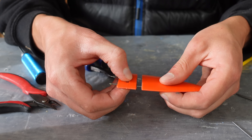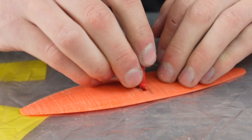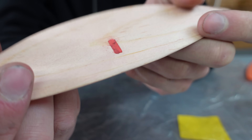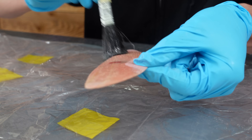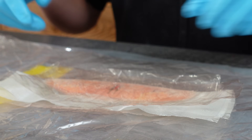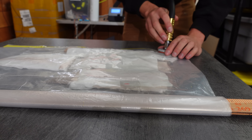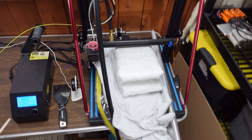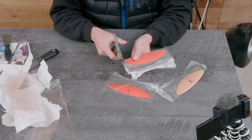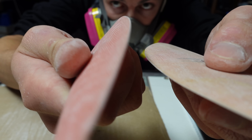I printed these in three parts and glued them together with some rods for alignment. The major downside to 3D printing these is that they have little FDM ridges, so I had to do a whole lot of sanding. Once they were fairly smooth, I plugged the rectangular holes with clay so they would not get filled with resin when I fiberglassed them. I mixed up some epoxy and painted it on the foil, then covered the whole thing in a few layers of 2 oz glass, wetting the cloth with epoxy after each layer. After the fiberglass came a layer of plastic film, then breather cloth to help smush everything together when placed in a vacuum bag and the air is pumped out. I used my 3D printer bed as a curing oven, and a few hours later I took everything out of the bag. The fiberglass turns clear when epoxy resin is added, so after that I trimmed the edges with scissors and sanded them down. I cut away the fiberglass from the clay-filled holes, picked the clay out, and sanded the fiberglass down nice and smooth. Here you can see the nice sharp trailing edges.